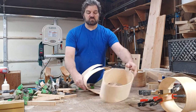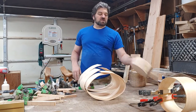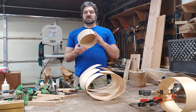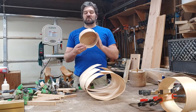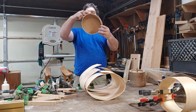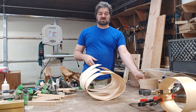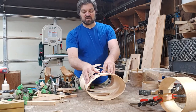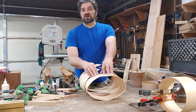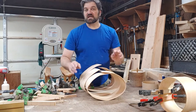This is the worst of the three, this one's a little bit better, but the one I did by hand — not a problem whatsoever. That one was my single entry piece: split, cut, planed to thickness, all completely by hand, and then bent without a form. This one is not glued, just laced down. You can see it's raised up a little bit and there's a slight gap, but it actually goes together a lot nicer than some of the ones without gluing it. I found this a really fascinating piece of evidence that I'm on the right track with maybe not using forms and just bending by hand, by how snug this was without any glue whatsoever.